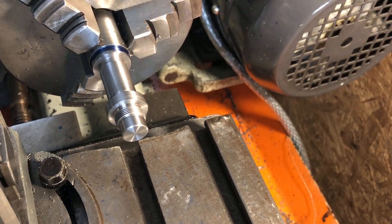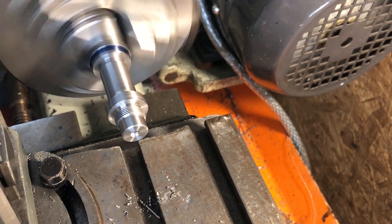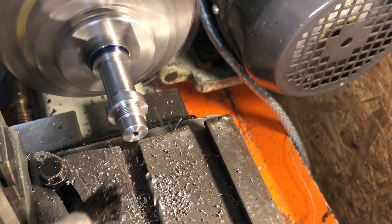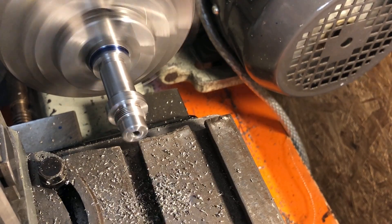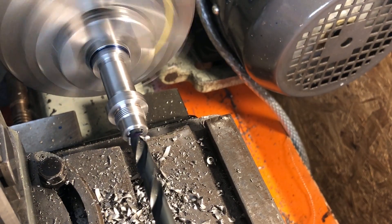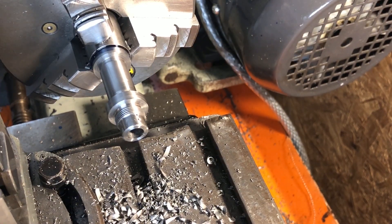The dimension on this is 5/16ths to fit the plunger, and as usual I'm starting with a centre drill, followed by increasing sizes of drill bit. Now the depth here is reasonably critical, as this part will eventually be faced to length, and I don't want to break into this bore when doing so. With that in mind I've marked each drill bit approximately one 30th of an inch short of depth with a sharpie. With the drilling done I can set up the boring bar for final sizing.